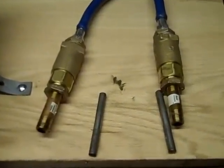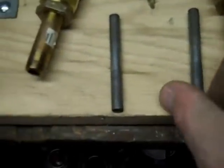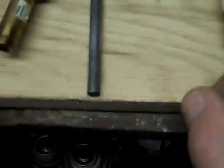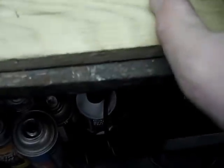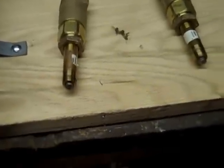Here are the two check valves removed. These two rods I just cut from regular rod stock — they fit pretty snugly into the connection that goes to the ball valve. The rod extension goes pretty close to the top of the piston so there's not much rod actually sticking through. But that's all it really needs — just a short throw — because there's a lot of pressure on the other side of that, and all it needs is one quick burst to really make the engine run pretty well. I suspect I could get a little more power if I had a smaller diameter rod so there could be a little more blowby and the air could pass by easier.